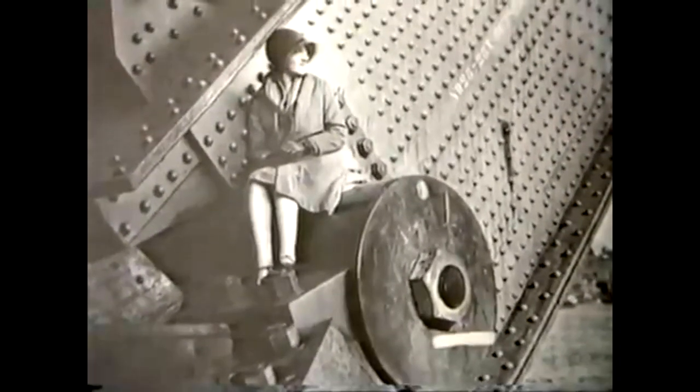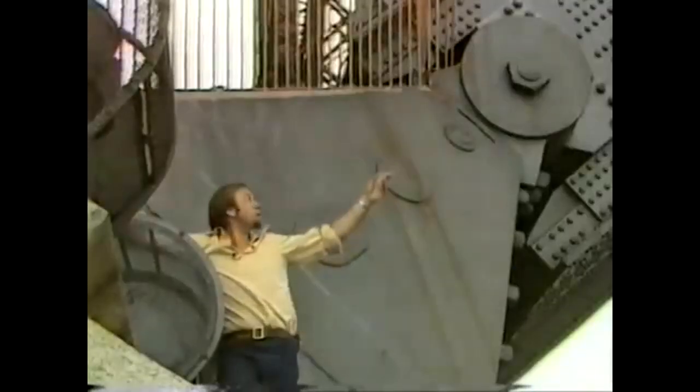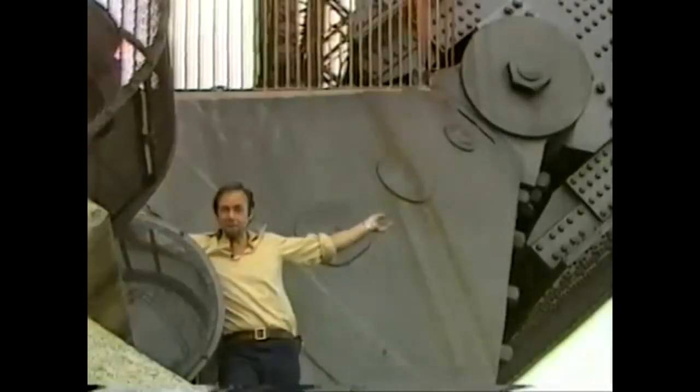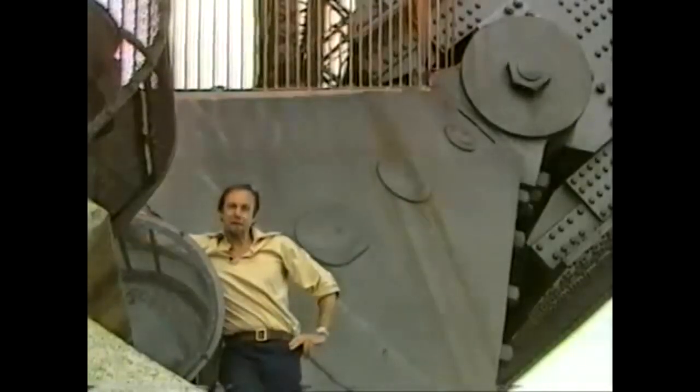But once they were joined, the critical points were now the bearings on each side of the arch, because pretty well all the weight of the bridge comes down to these points — the bearings on this side and on the other. Why not simply bury the ends of the arch in the earth on either side?